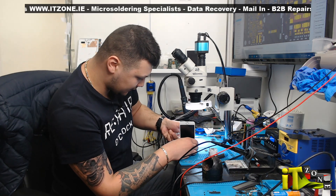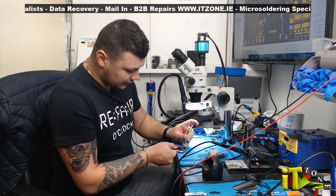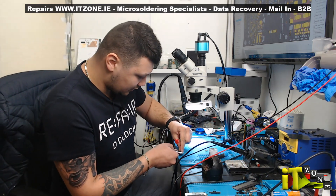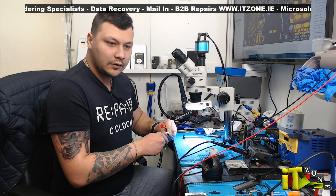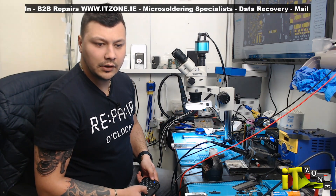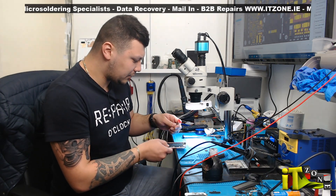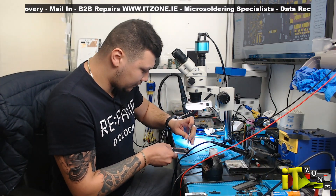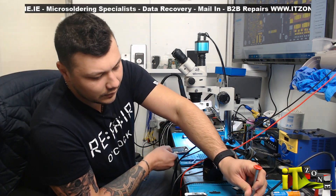VCC bat — it can be Wi-Fi, definitely not. So what I'm going to do is take the board out and inject power straight into VCC main. That's just to bypass the switching MOSFET between main and bat. Sometimes we are lucky and we can see from visual inspection the shorted cap.